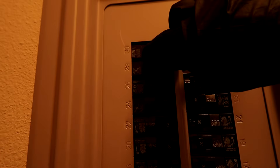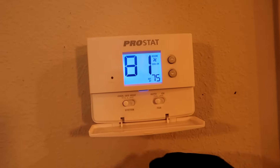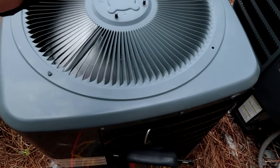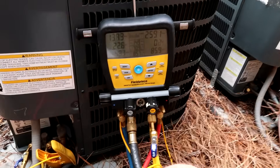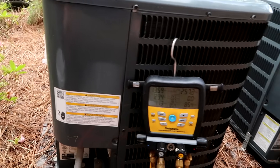Let's turn the breaker back on — hope it stays on, come on big money no whammy. We want it to stay on when we fire the unit up. Put it down to 75 — there we go. I hear refrigerant moving. Let's just take a peek at the charge even though that's not why we're here. We're here because the breaker popped, but hey, the call guy would love me. It's running — no breaker poppage. That's the culprit right there: a bad hard start. These doggone rotary compressors, not aging well.